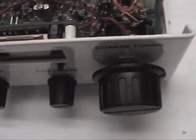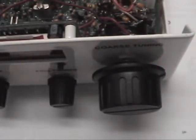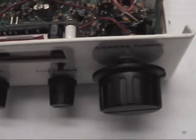One thing I noticed with this knob is that the shaft is a little bit too long and sticks out a bit too far from the receiver. We can fix that by cutting a little off the shaft of the potentiometer. But if you do cut the shaft using a hacksaw or anything else, be sure that you clamp the end you're going to cut off in the vise — otherwise if you clamp the pot body and try to cut it, you'll end up ruining the pot.